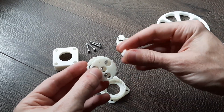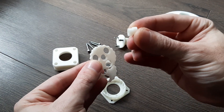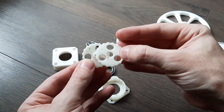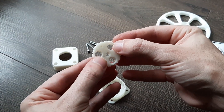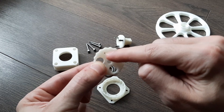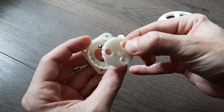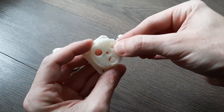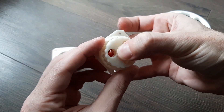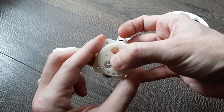So these two gears are distinct from one another. One goes down, then you insert the eccentric shaft with the part up, and then the other gear goes in such a way that you can insert a pin in it. You have to assemble these gears in the right way or else you cannot assemble it. There is the pin registration — you can see it's aligned — and then you can insert it in the housing.